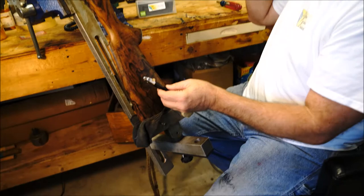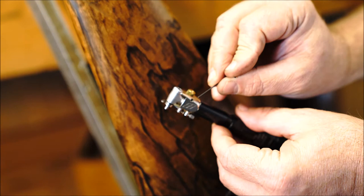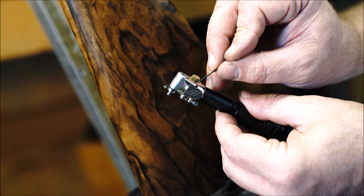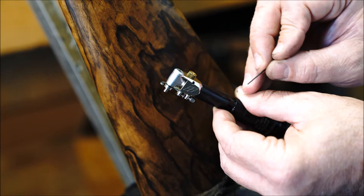When you purchase a Titan Power Checkering Machine, you're going to receive a few wrenches. The first will be a 35 thousandths wrench, which holds two screws that retain a spring and plunger for the lines per inch adjustment. If you're doing fixed lines per inch and production checkering, you can screw these down completely and lock it in so that the adjustment won't be changed.